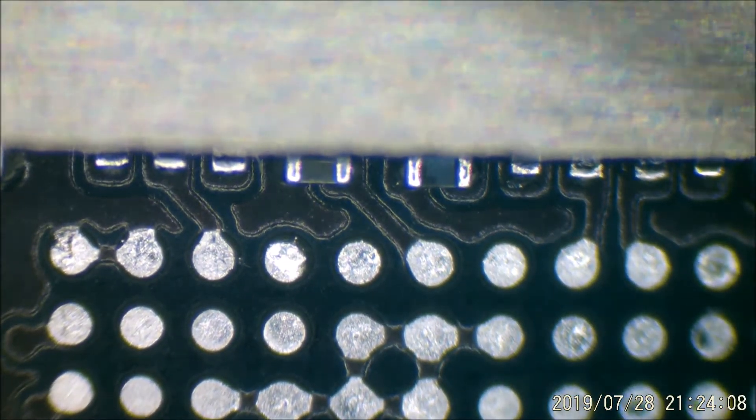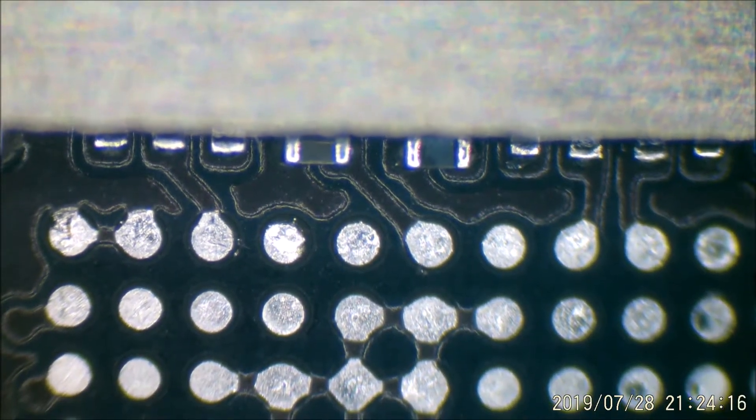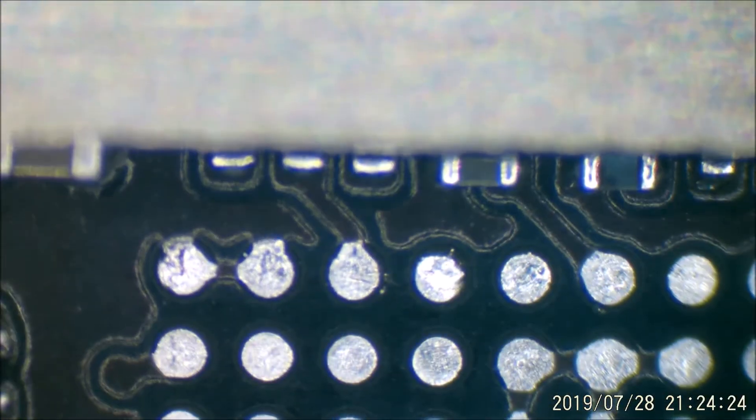You can see the four traces at the top on the top line: C12, F12, H12, and J12. C12 is the main culprit — it will give you issues like long boot time, no loud speaker when making calls, and it could affect headphones. H12 and J12 I believe are responsible for the headphones or microphones on the headphone jack, though I can't remember exactly where I got that information from.